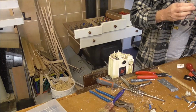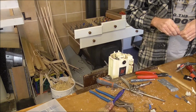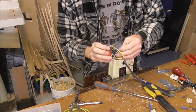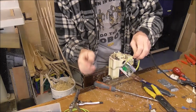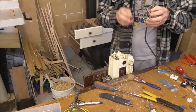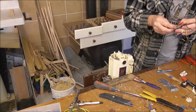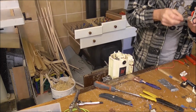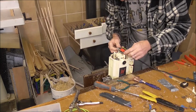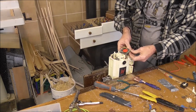Okay, so that soldered to there and that soldered to there. Seems straightforward enough. Okay, after beating a stubborn bit of soldering work there, it would seem everything's gone back together. Put some oversleeving on first so I could slide it over the solder joints. I can take that tape back off now, not that it matters either way. We'll screw it back into there with the heatsink. Right, that is there. Right, now, a way to get all this lot in there without causing any problems.